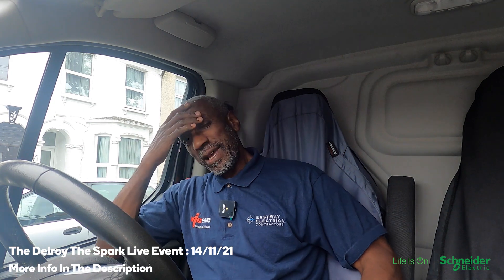Well that's the end of that job. What threw me was the fact that it's all RCBOs and the fact that it would work in that other circuit without tripping no matter what he did. But I suppose if he'd used it in that circuit continuously it would eventually trip because there was a fault on the appliance — it's usually the appliance causing the problem. I never rush these things. I make sure I test the circuit, test everything. Plus he had a 40 amp RCBO in there and the cable is only 6mm, so most it should be 32 amp. Anyway I fitted a lower MCB and gave him a new cooker switch — it's better than the one that was there. The circuit's fine, it's definitely the oven causing the problem. Someone's going to have to look at it. Thanks for watching, see you again.